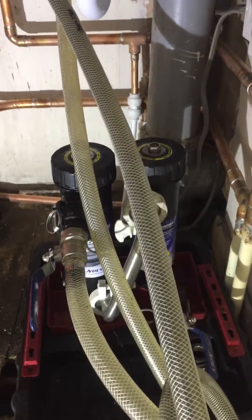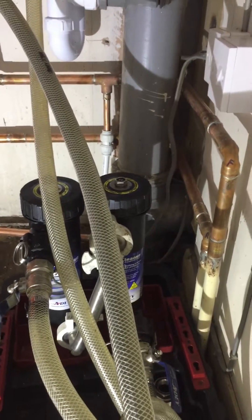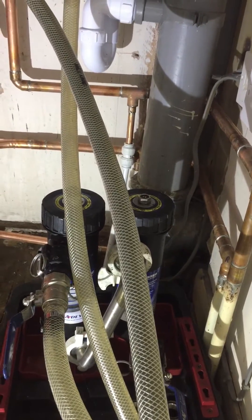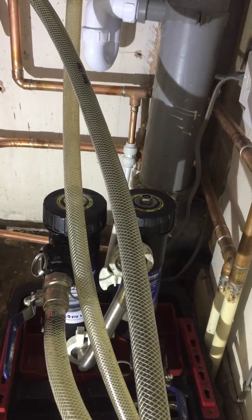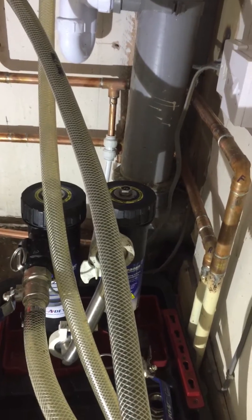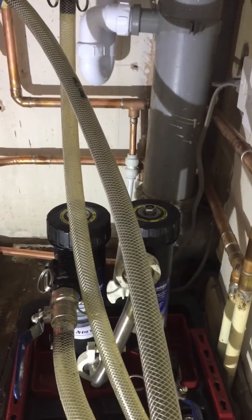Basically, if you don't do this on a new boiler, you're going to screw the boiler up pretty quickly and invalidate any warranty. And there you go, it's getting even worse now. So what we do is keep letting this go clear, then go back and hit the radiator again, and just keep repeating that until it comes back clear. Hopefully that helps — take care, bye!